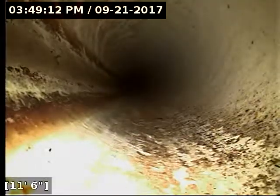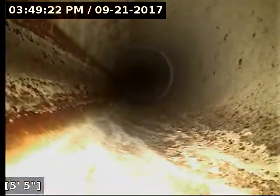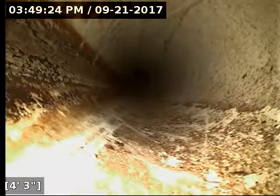The interior pipe I'm more concerned about. Again, we have that section of pipe under the vanity in the basement that looks like it may be wearing out. If it's not, it's not a terribly bad belly. But my concern is the pipe's about to wear through there. And then we do have some grease and debris caught throughout the line, so I recommend jetting the sewer line from the cleanout inside the basement, jetting all the pipe underneath the basement floor, and then re-scoping, and hopefully that will give you a better look at the pipe under the floor there. Once you can get all the debris out of there, then you know what's pipe and what is not.